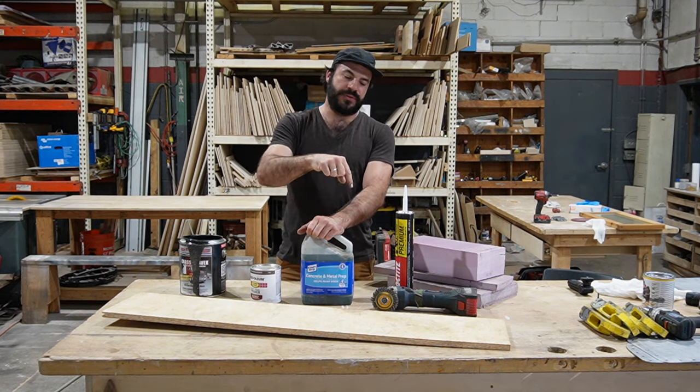Okay, so we're back for day number two of our subfloor installation. I went ahead and took all of the weights off of these front two sheets because we'll obviously be putting more stuff on top of them. Put them on the back, and I already got this sheet cut, but I'm about to cut my next sheet here of insulation, my second layer. And I wanted to bring you in and show you something that I did in my layout phase that you'll want to consider, because it's going to make navigating these wheel wells easier for you, and it's also going to make your floor a little stronger. So let me bring you in and show you what's going on.